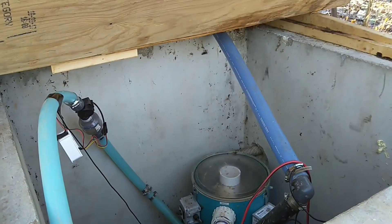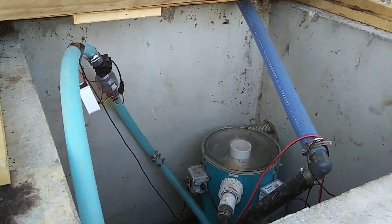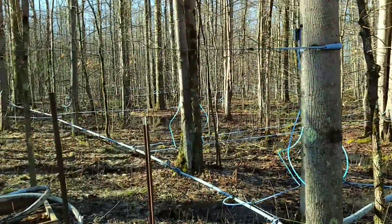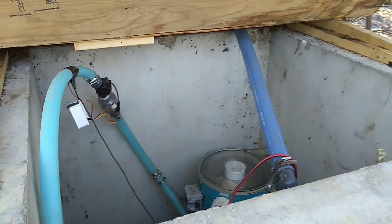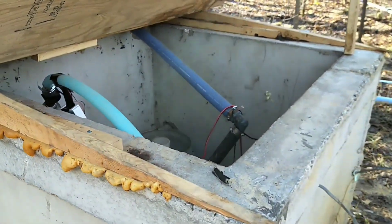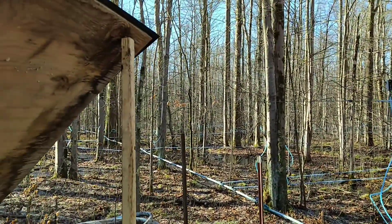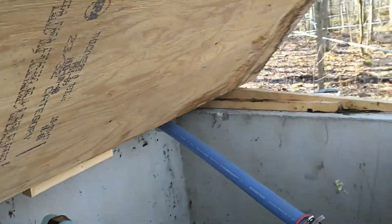Here's a conundrum. Vacuum can wreak havoc on your flow meters. We replaced every drop in this section and we have an overall output meter on this woods. We have an electric releaser and a concrete vault that sits a little bit below grade, so we can drop all the sap down into this electric releaser. The goal was to see how much additional sap we can get per tap out of this section of the woods, and about halfway through the season we got our flow meter on there.